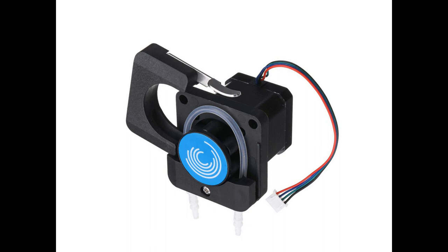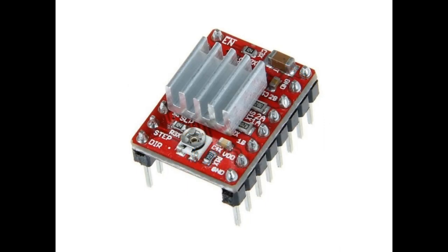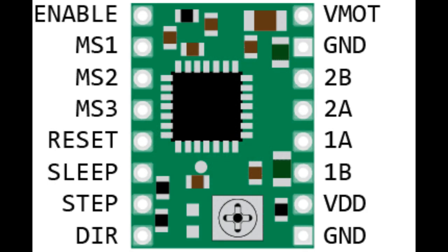To get this system working you need to understand how stepper motors work — there are many good videos explaining that on YouTube so I won't go into it. I use an A4988 driver. It has four output pins to drive the two coils of the stepper motor, and other pins for the motor power supply, a lower voltage supply to power the electronics (VDD). There's an input pin that you feed a square wave to where every cycle moves the motor one step. There's a sleep pin, a direction pin, and three micro-step (MS) pins that determine how many steps there are per revolution. The maximum number of steps is 3200, determined by all the MS pins being high, which is what I use.